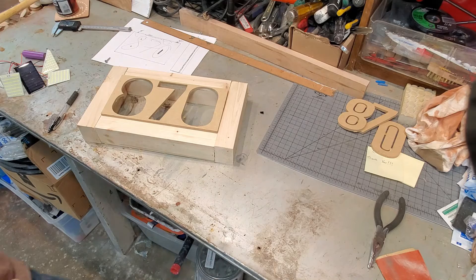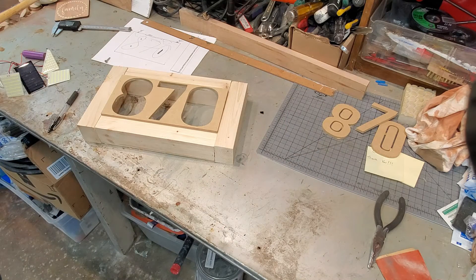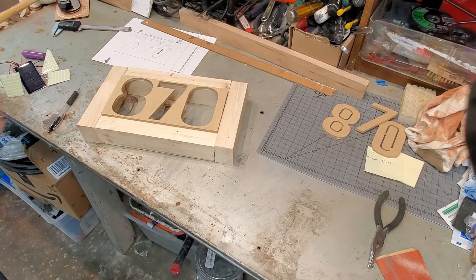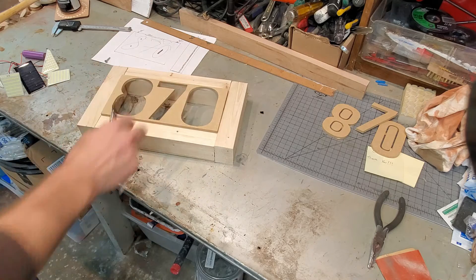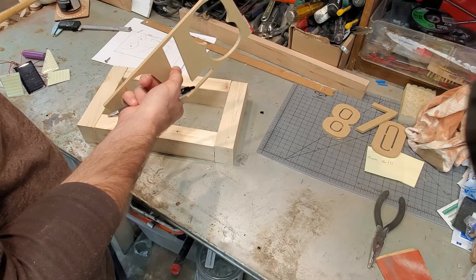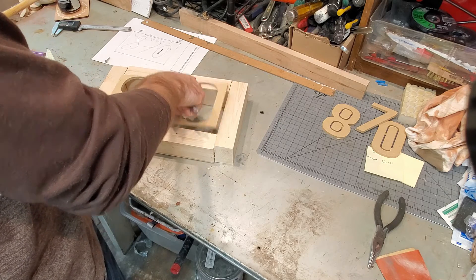I'm not hating on it. Is it going to look too big or too small? It might look kind of cool - just a box picture frame. Yeah, I think we're going to roll with it. We can always make another one. Next, I'm going to cut a groove in this piece and this piece to fit the MDF, and then it should slide right in here like so, which should get rid of that seam.